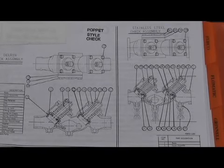But the majority of the small assemblies were the poppet style check, and those were started around 1978. But before '78, around '75-ish, they did make a small, meaning 3/4 or 1.5 inch, 308-1 check, but it wasn't made for very long. I'll show that to you when we get to the assemblies part. So those are all the Model double checks, RPs, double check detector assemblies, RP detector assemblies, and the 2-check pressure vacuum breaker produced by Clayval.